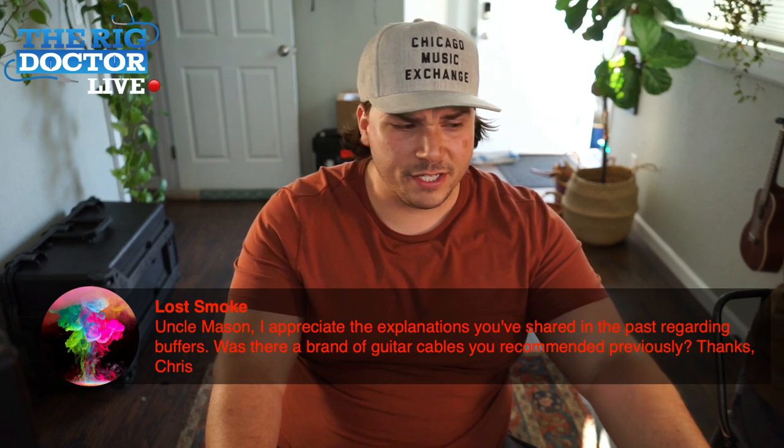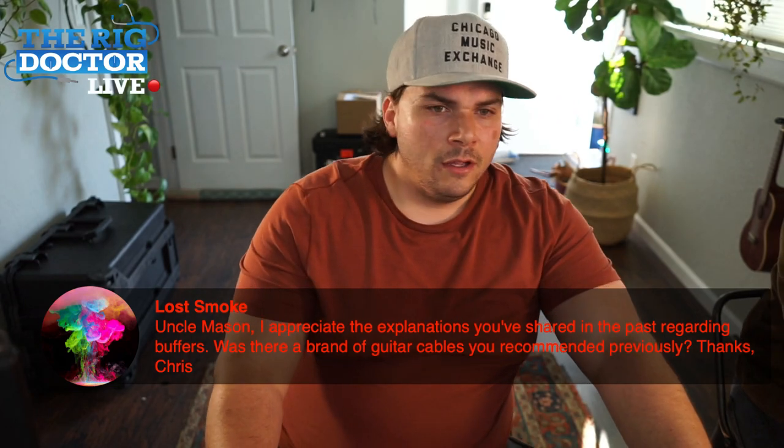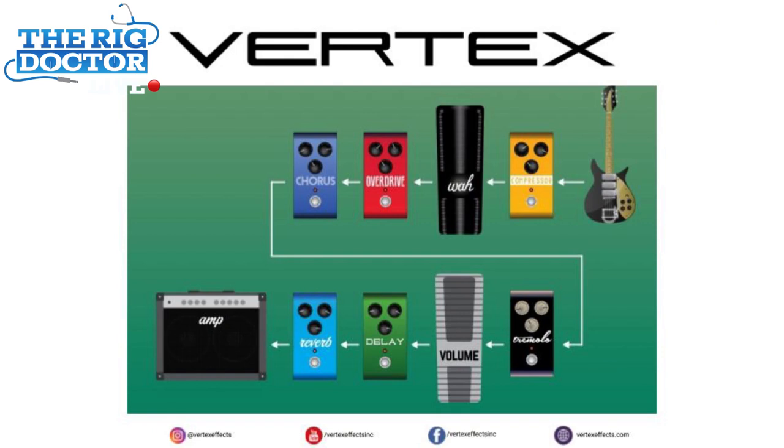Is there one from over here, Mason, that we can throw on here real quick? So here's one from Instagram by Grazer. He's asking, why does my buffer make my fuzz face sound like garbage? Okay, your buffer makes your fuzz face sound like garbage because, as we talked about with the fuzz face, if we go back to our fictitious signal path again, pretend for a moment that this compressor is now a fuzz face. You would not want to have any buffer in front of it because of that word we talked about a little bit earlier, impedance, meaning how sensitive is it?